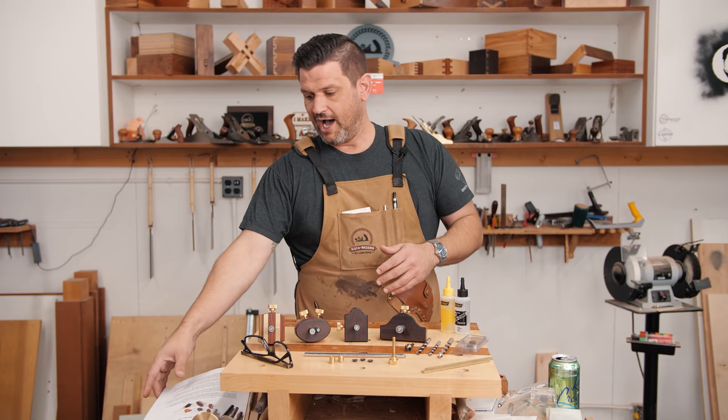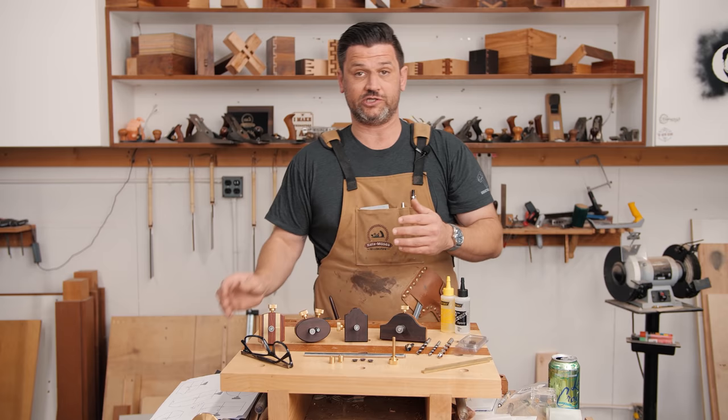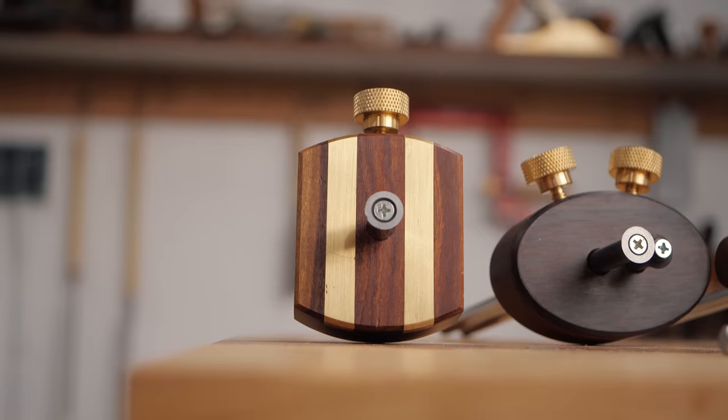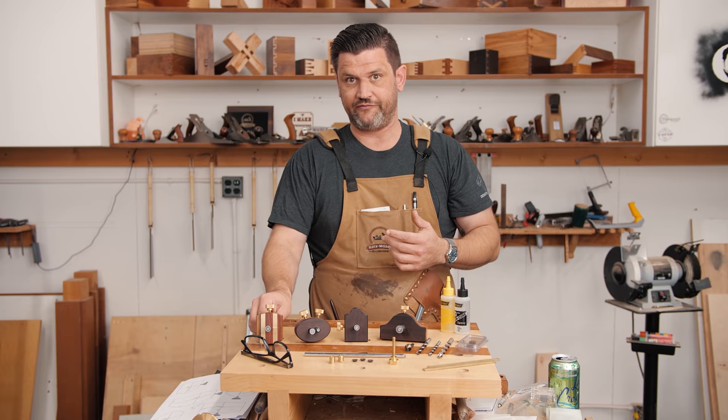Here's a few that you can make. There are step-by-step instructions as well as eight templates if you don't want to just make your own. The only thing about a marking gauge that is important is that the rod is perpendicular to the face and the face is flat. After that, it can be anything you want. He has some other accessories you can get, like some brass inserts, which are just wear gauges — if you're a massive marking gauge user, it would be helpful.